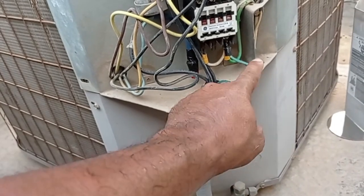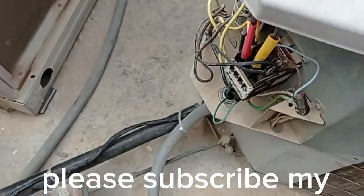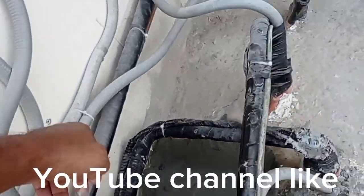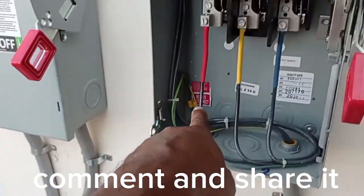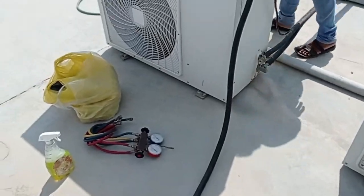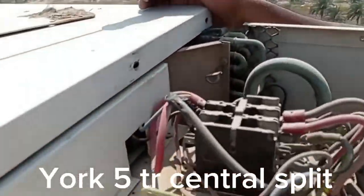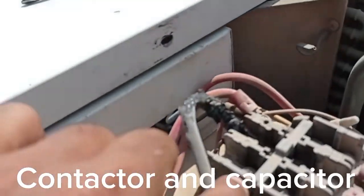This is for the outdoor unit — I show you the indoor unit now. See, from this one coming number two — this is the ground, they are fixing with power. This is the ground. We are here today for troubleshooting. We found the problem now — the contactor is defective, must be changed. It is burned.